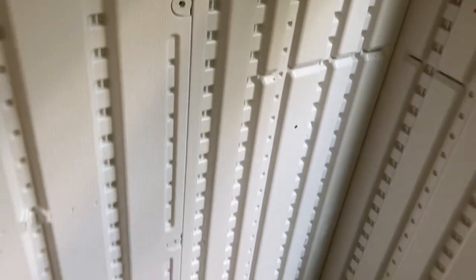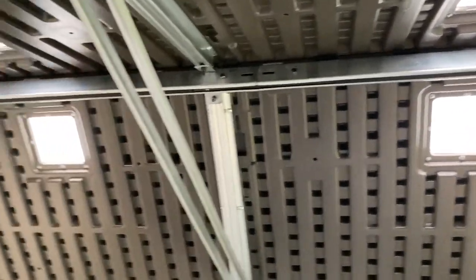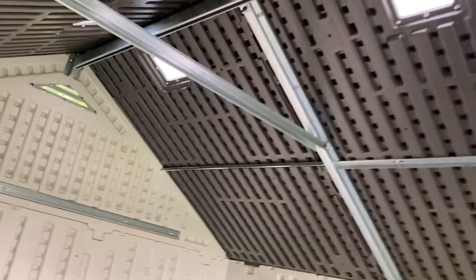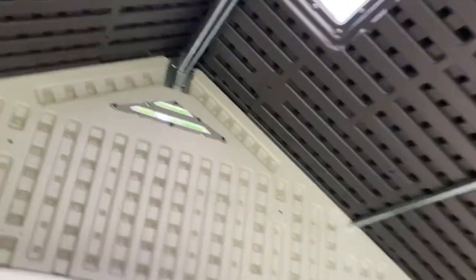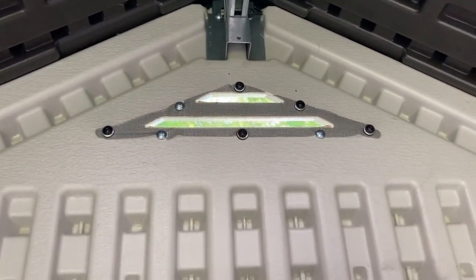These little plastic things legitimately do nothing, and there are no other braces that run along the middle of the wall — just a center beam and a couple of cross beams. For snow load, this thing is only rated for eight inches. I do get more than that here in the winter, but with the pitch of the roof and being under some trees, I'm confident I won't get that much snow piled up. If I do, I can just rake it off — it's not that tall.